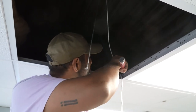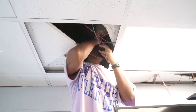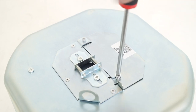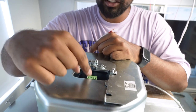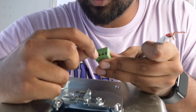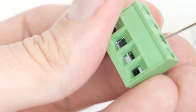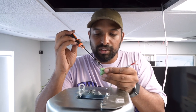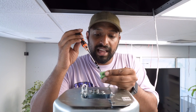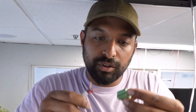I ran the speaker wire using the broomstick method, which is a great way to get wire between spaces when you don't have full ceiling access. To wire the unit, loosen the Phillips screw that allows you to pivot and slide out, revealing the euro block terminals. Pull the euro block straight out — the inner terminal is positive and the other is negative. Since this is the last speaker in my chain, I'm only using the inner two terminals.